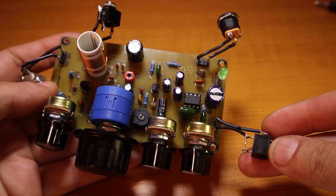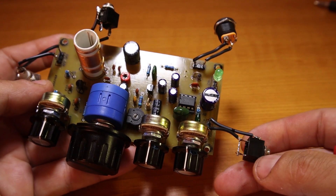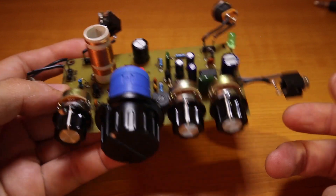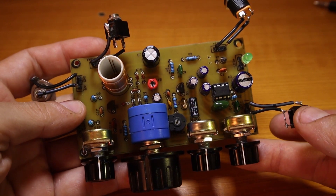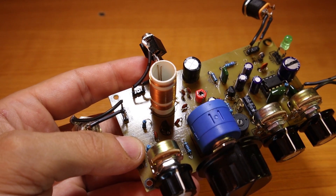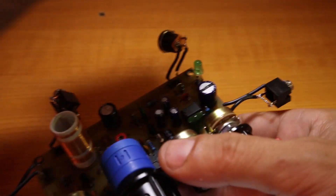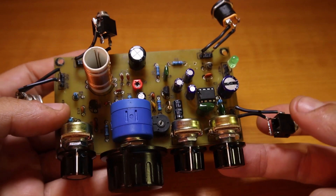You can also use a small speaker — the sound won't be very strong, but if it's quiet in the room it might be acceptable. It's really meant for headphones though, especially for portable use. If you want louder output, you can connect a homemade LM386 audio amplifier on the output of the receiver and then have a big speaker on the other side — it gets quite loud.